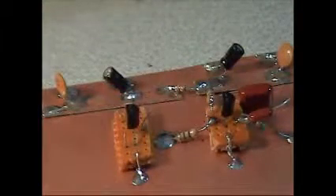We're going to start with another 470 ohm resistor. The color code is yellow, violet, brown, and that's going to go to the emitter lead of our NPN transistor. We'll squeeze the wire together, solder this down, and then solder the other end down to the circuit board.